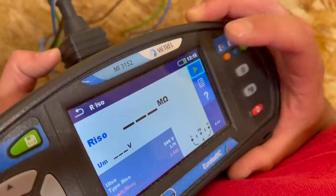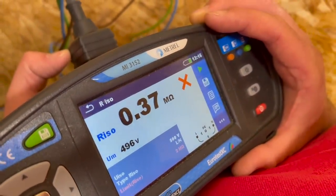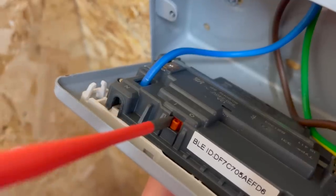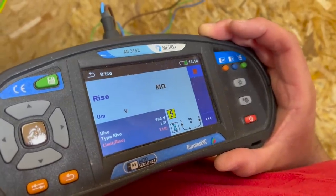Now for a great electrical installation feature. Electricians often face challenges when conducting initial or periodic testing on sockets that have built-in electronics. The internal circuitry can interfere with insulation resistance readings, requiring the socket to be disconnected during testing. Luckily, MK has included a helpful solution in the form of a red switch which disconnects the internal electronics, making testing much more straightforward.